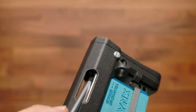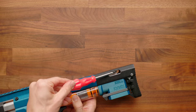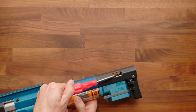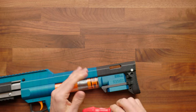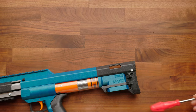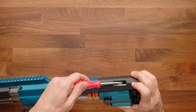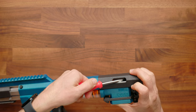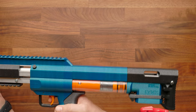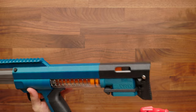When you have the pusher in the farthest back position, you can take a screwdriver and actually adjust it — you can dial that in or out. If you tighten, meaning this way, you're going to increase your air seal, and if you go the other way and loosen the screw, you're going to decrease the air seal. What's happening is you're essentially compressing that o-ring together, which makes it wider. You want to do this in very, very small increments. I'm going to go ahead and truly do this because I think the air seal might be leaking just a little bit. I've tightened that just slightly and we'll try again and see if we get any better performance on the actual air seal itself.